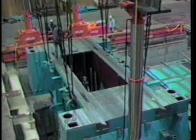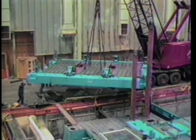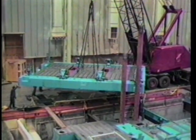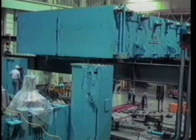Leveling was critical. Cold-rolled steel shim pads were used to achieve a tolerance of 12/100-thousandths of an inch per foot. Working with limited headroom, necessarily smaller cranes, and a severely restricted deadline required Atlas to develop alternative methods for assembling the press.